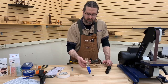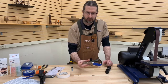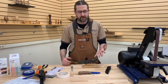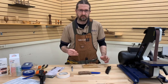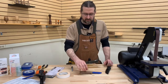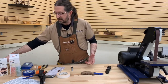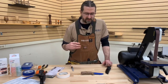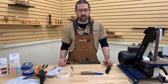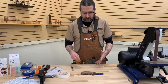That brings us to this one that I was doing yesterday — obviously it's still pretty rough. I was using brass pins for it, and we'll see how this goes through the sanding process. Are the assembly and epoxy steps the same when using mosaic pins? Yes — that's a very good question. Mosaic pins are very pretty and the contrast they can create is exceptional, but on their outside they're still essentially a straight pin. So the assembly and epoxies you would use are the same.